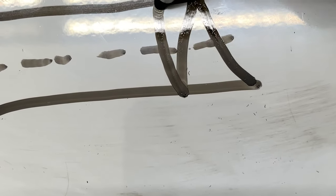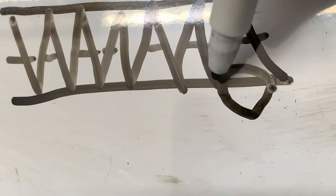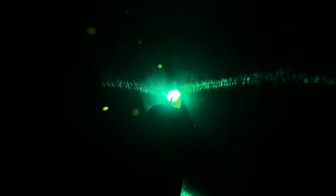So first off, obviously you're going to get your plate tacked together, and the manipulation we're going to do for our first pass is a quick side-to-side, like a zigzag. This is the pattern you're going to use your MIG gun to trace across. We're going to go pretty quick, and we want to make sure we overlap each pass with the next.